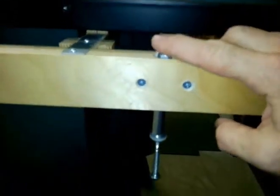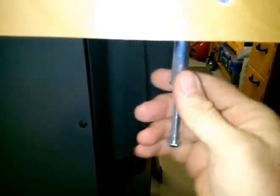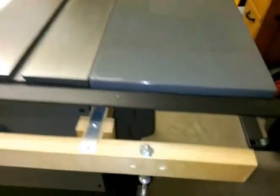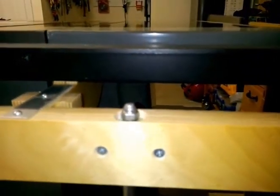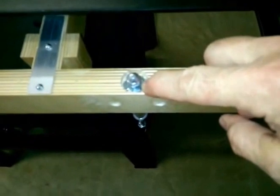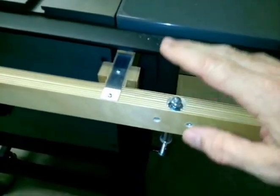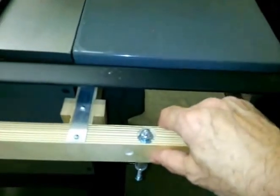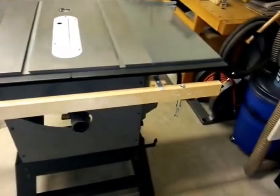Right here are my levelers — basically nothing more than a long bolt, a T-nut to help lock it in the up position, a little spacer since my sleeve comes down a little farther so I can reach it without reaching way up beside the spacer, and then an acorn nut. When I raise and lower, as you can see it just goes up. When I want to lower it down, it goes into a little T-nut inside there that I've countersunk into the wood. These two screws are just to keep any pressure from separating the two pieces of laminated boards. So that's basically the rail system, and now I'll show you how I connect it to the table saw.